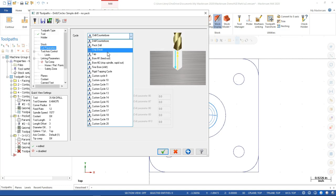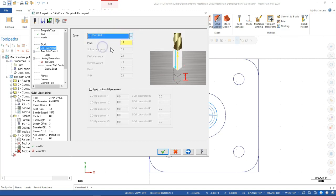Yes. How would you determine to do a ream operation without seeing tolerances on the print? I want to add an additional operation, so it's one of those, again, it's optional. If you want to throw the reamer in there, it gives you another operation, since I don't look at these and go, oh, half-inch hole's too easy. So if you put a half-inch drill in and you don't put a reamer in, I'm not going to be upset about it.